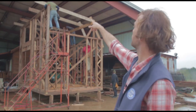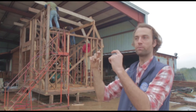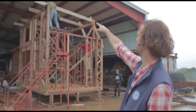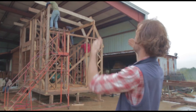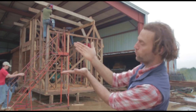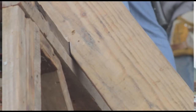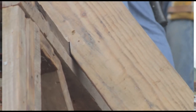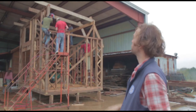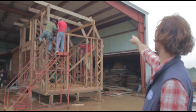What's difficult to see from this end is we've cut what are called bird's mouths in the top and bottom of both pieces. The bird's mouth is essentially a little relief cut so that the board sits flat on the rafter, since that piece of wood wants to sit at an angle. We'll get some still photos of that and I think that'll be self-explanatory.